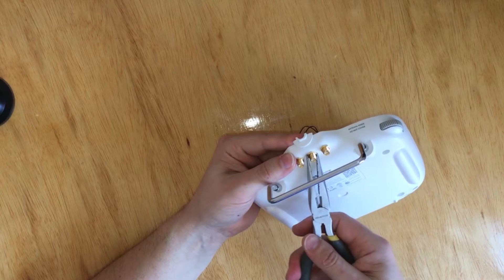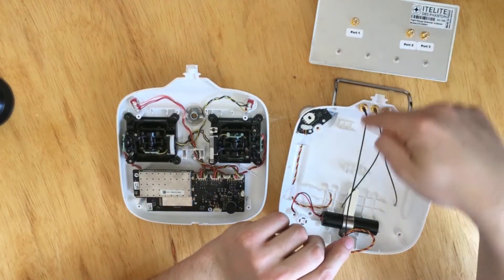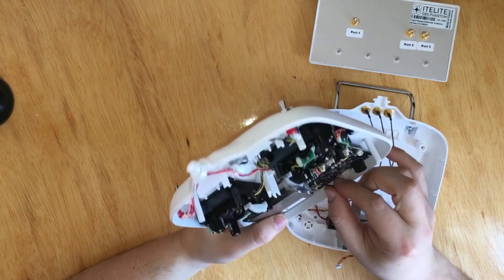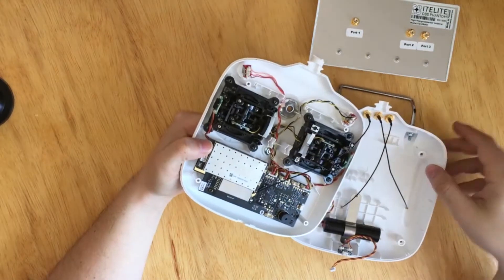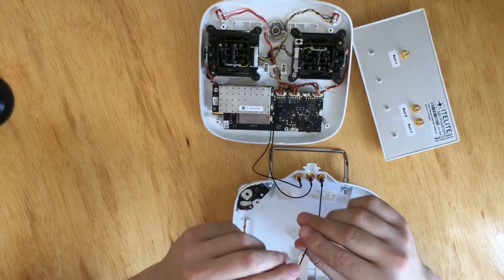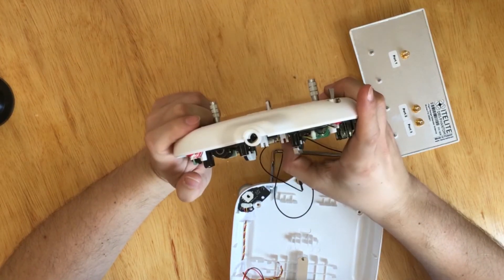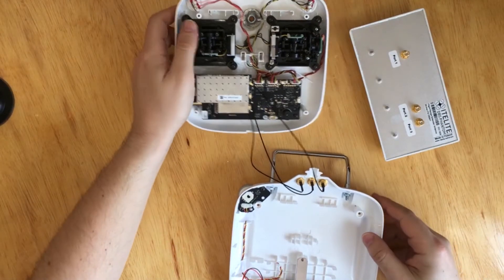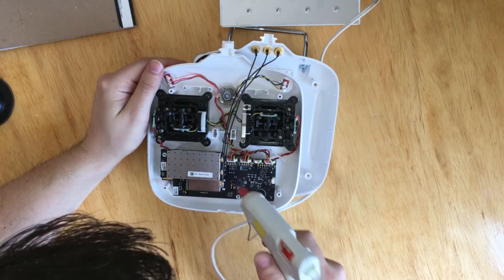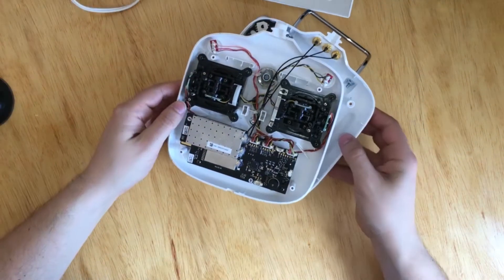The way I want to set them up: the left one is the main port. If you remember, the bottom cable was for the main antenna, so on the DBS antenna, port number one on the left is the main antenna. The middle will be the left Wi-Fi antenna and the right one will be the right Wi-Fi antenna. Make sure the connectors snap in place and are secure. After that, I glued them with hot glue to all three, making sure they'll never come loose.